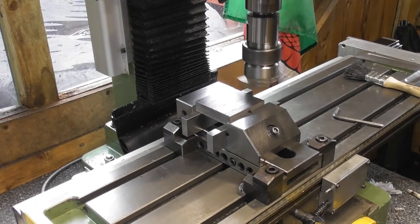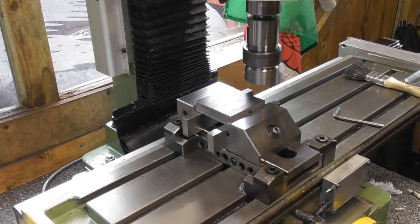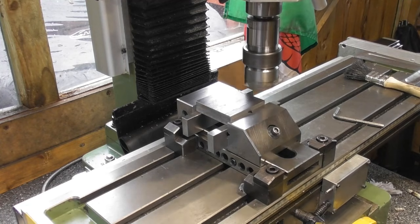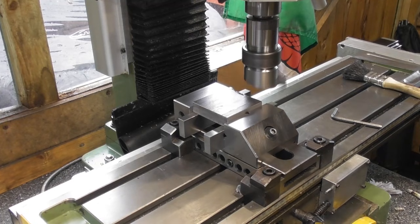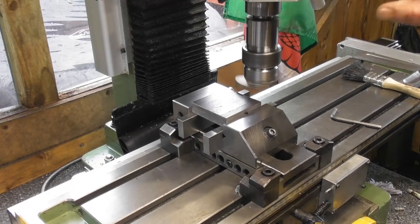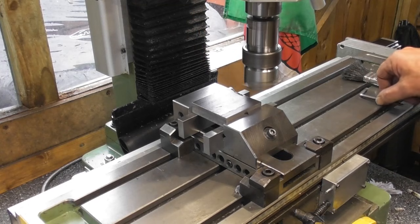Let's have a look at what RPM we're doing. Yeah, it seems reasonable, 500. Set on about 70 mil diameter, the fly cutter. I'm going to come down to a touch. Okay, let's just come off the part. That skin's a bit tough. I'm just going to take a 0.1 cut. Set a zero there, lock the quill. Let's see what that gives me.